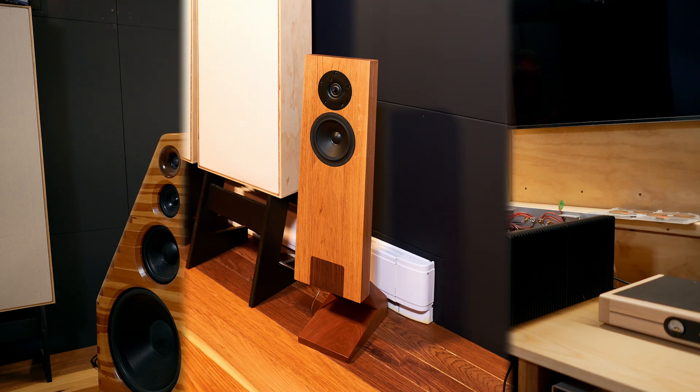I also have another pair of speakers out to the side. These are my reflection replacement concept speakers, where I'm treating the sidewall reflections from the main speakers by absorbing as much as I can, and to kind of simulate replacing that, I've made two smaller speakers on the sides that fire directly towards my listening position. They don't change the character of the soundstage, which is massive — very wide, wider than the speakers themselves, tall and deep. It just pulls me more into it, makes it more immersive, deepening that soundstage in the front-to-back range.